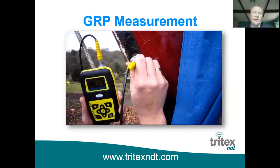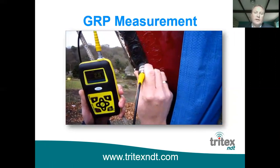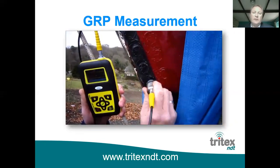So around here, you can see now you're getting 8.3, 8.2 millimeters, highlighting that there's been some work there and there's a thicker GRP level. And then we go back down to 2.5 again.